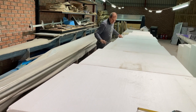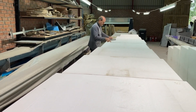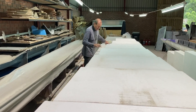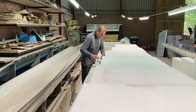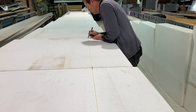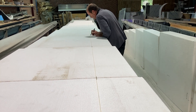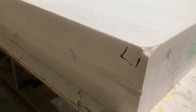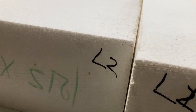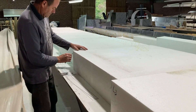Now Rob's laying out the left wing, and he's remembered that he's not going to build two right wings. So he's marked out a right and now he's marking out a left — holding thumbs. There's the marks for the front edge of the spar, left wing, on each block using the gut line. Joint 1 left wing — L1, L2, L3, L4, etc.